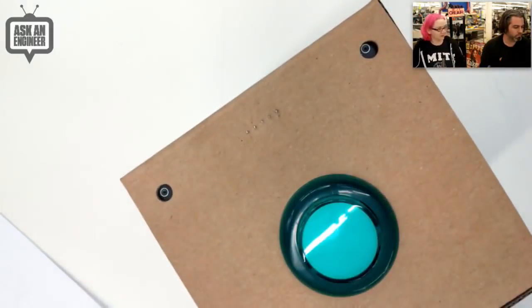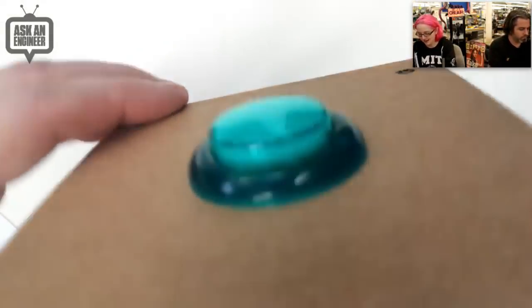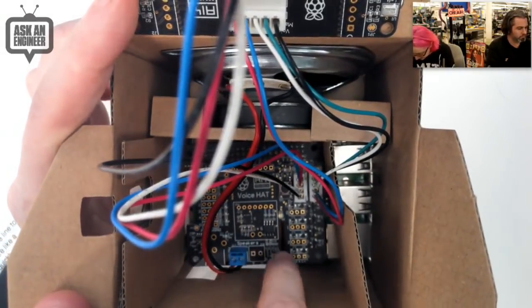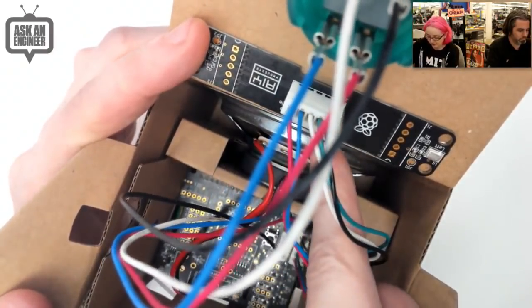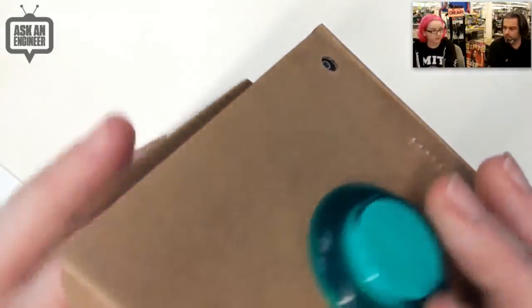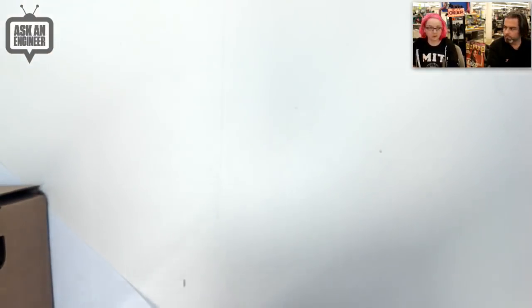I thought maybe I could actually take this apart now that we're done with the demo. Let's unplug it and quickly take it apart. Inside you can see there's a Raspberry Pi and then the voice hat. The voice hat is hackable — you can connect servos and breakouts. There's a speaker, but you can add a second speaker for stereo. The speaker wire goes over here, mounts into the cardboard box, and you've got an arcade-style button plus a dual I2S microphone that works with the voice hat.